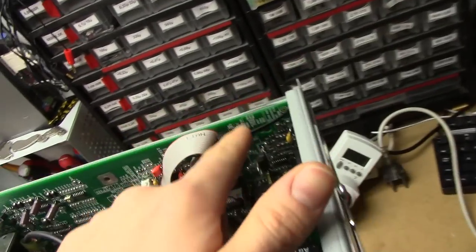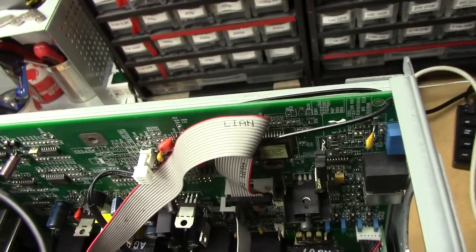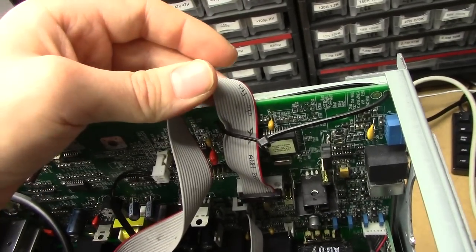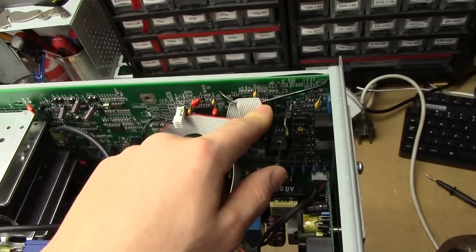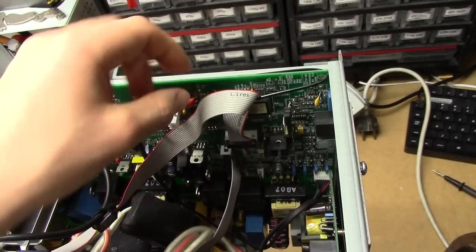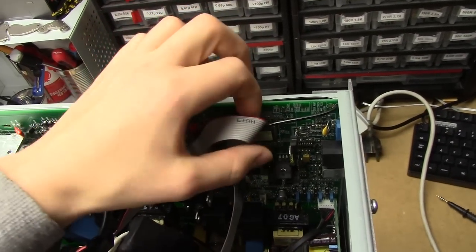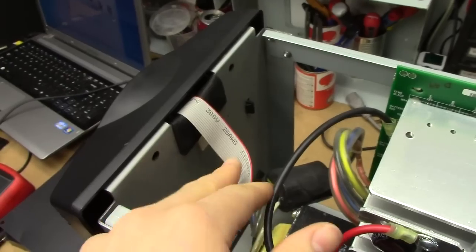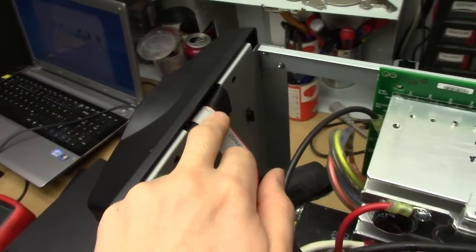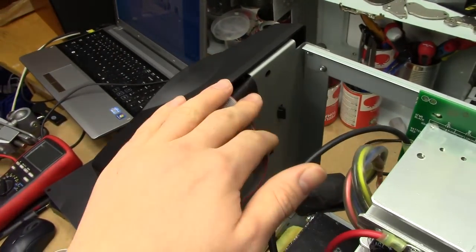Although, real weird, is this wire for the front panel is just held in with a zip tie. That's just weird. They are making these custom smart slots and custom plastics, otherwise I don't get why they wouldn't have a proper mount for that. I mean, just one of those little metal screw hole bendy things which you wrap around the wire would be more suitable, but yeah, it works, I suppose. It's just nice to see that they've moved away from the thin plastic wires they usually use for these panels and just gone with a standard multi-conductor wire. So that's pretty nice to see.